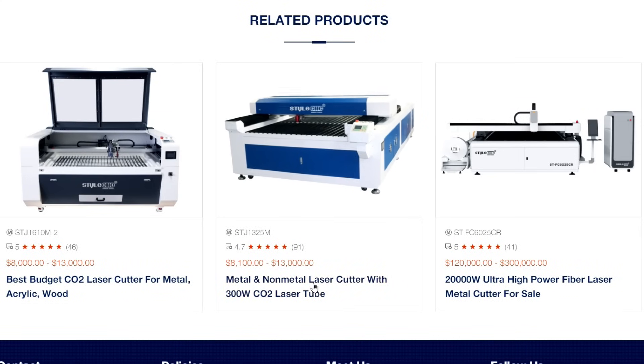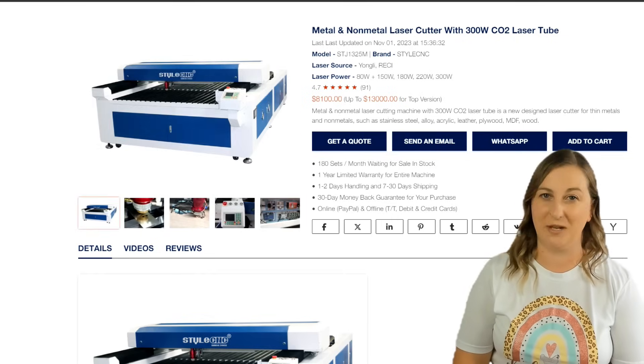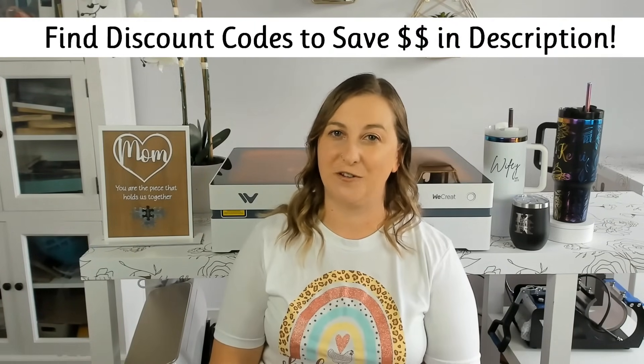The cons: fiber lasers are extremely expensive. Really good fiber lasers start at around $10,000 and can easily reach $30,000 or more. They're best for businesses that need to engrave a lot of metal. Fiber lasers are great for metal but not suitable for wood, acrylic, or glass — if you want versatility, this isn't your best bet. To summarize: diode lasers are best for beginners focused on wood, leather, and coated metals. CO2 lasers are the best all-around option for versatility and power, ideal if you want to work with a variety of materials. And fiber lasers are perfect for businesses focused on metal engraving — high cost, but unmatched precision.